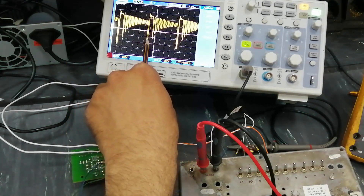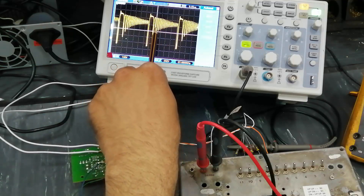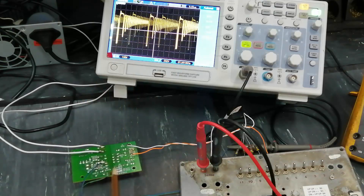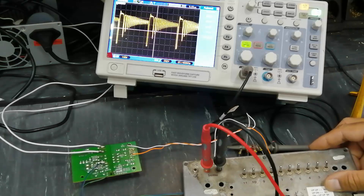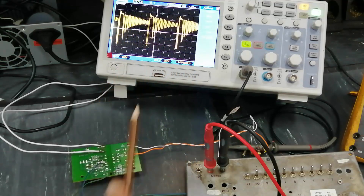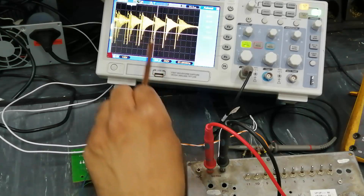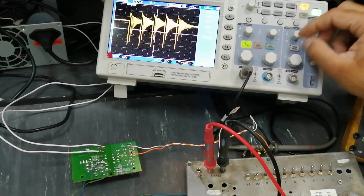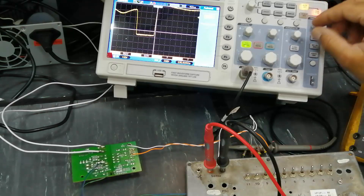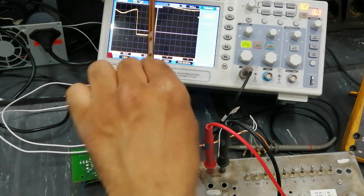The pulse duty cycle is from here to here. After that there is an oscillation effect of the primary coil — this is the damping effect due to the diode, resistor, and capacitor on the primary. Without load, there is just a slight, narrow switching-on time pulse. Now I apply some load — frequency and duty cycle started to change. Adding more load, the duty cycle shifted to a larger on-time. Adding more load further, we can see the duty cycle is enlarged and switching time increased.